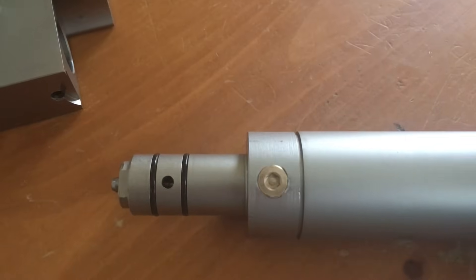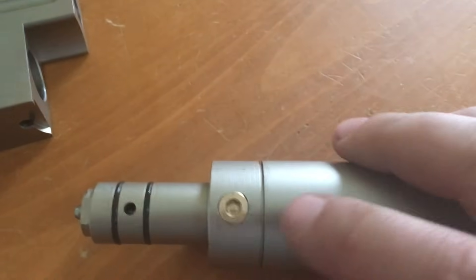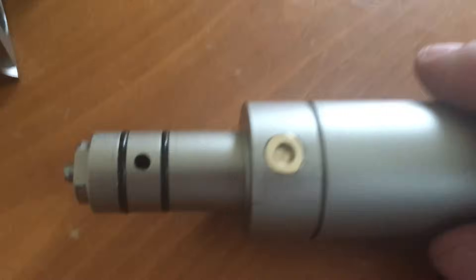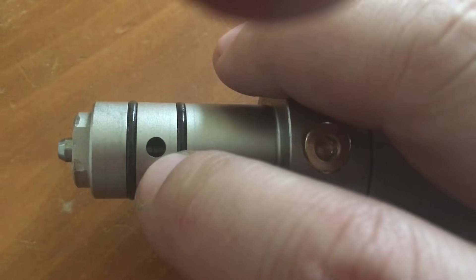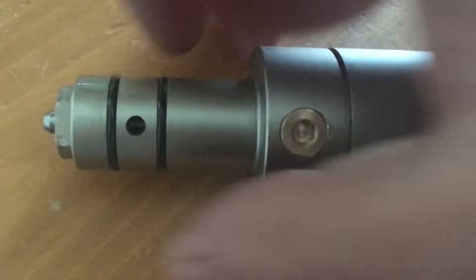The valve itself is all part of the tube cap. This is a burst disc — so if you were to overfill the tube, that burst disc helps prevent injury. This is the very first place that air comes out of the valve, the beginning of the transfer port. You can see down in there the valve opening up when the hammer strikes.